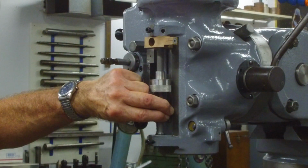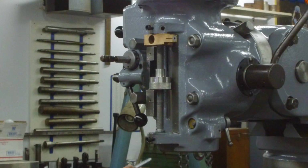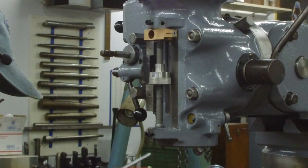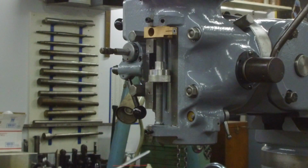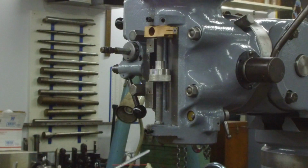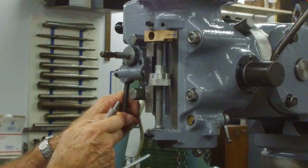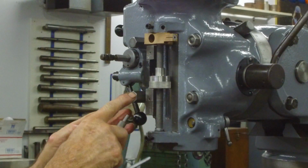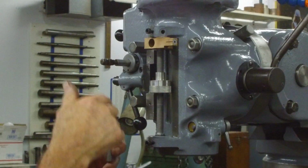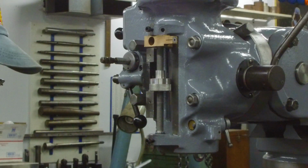Alright, snap ring is in place. This dog bone is held in with the screw, and this little push finger here goes underneath this side over here, and this rod here is a little nub on this side, about a 1/4 inch diameter, that actually pushes and releases the same pin that locks that in when it's there. Okay, so you either trip it manually or trip it this way, or the clutch will throw out and it will trip it. So it trips 3 different ways.